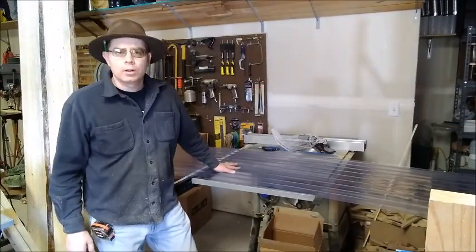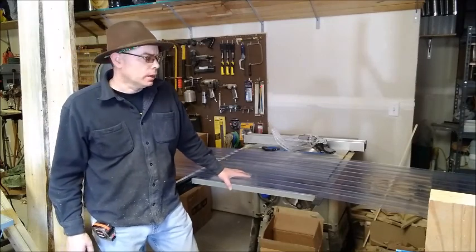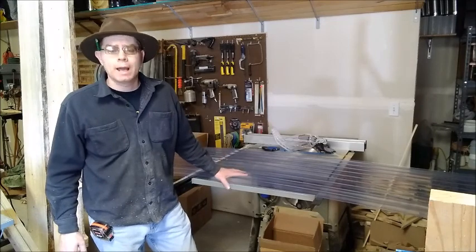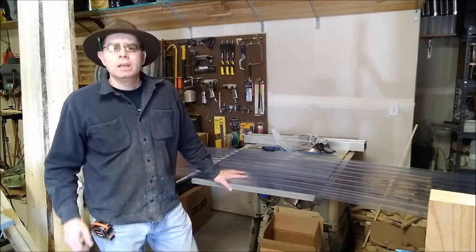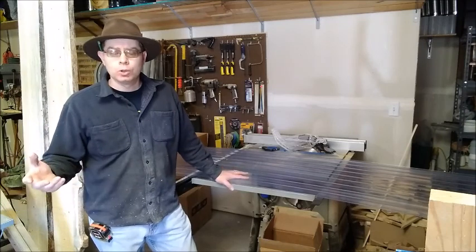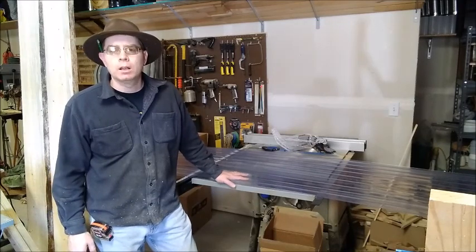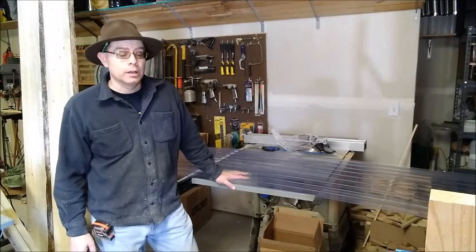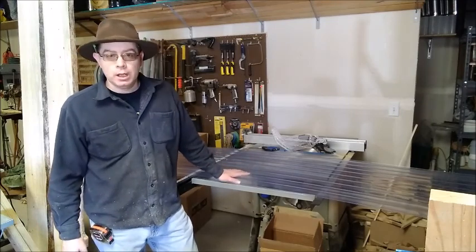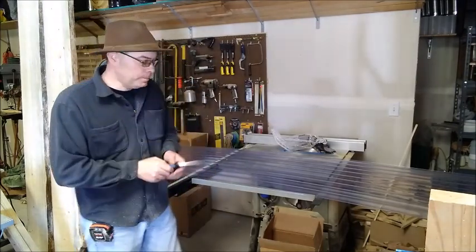While we're here in the garage we're going to go ahead and cut our corrugated plastic roof. A couple of things to note about these from working with them over the years: first, when you cut them you want to make sure they're warm. If this plastic gets cold it gets really brittle and as you're cutting it will chip or crack. So if it's cold, bring it inside and let it acclimatize for quite a while. The next thing is it can be very challenging to cut a straight line because of the corrugations, so you want to make sure you've got some long shears that are nice and sharp.